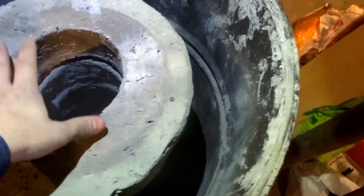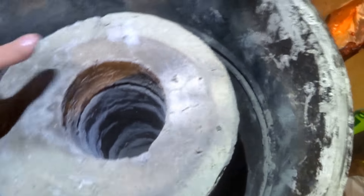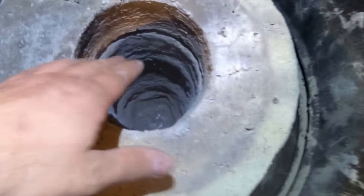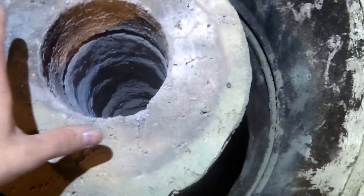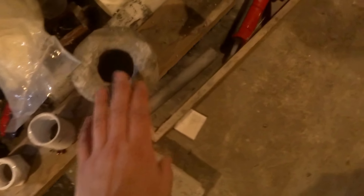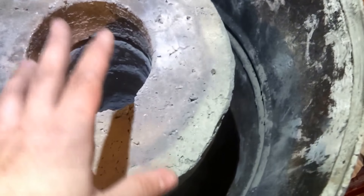I've decided to add one of my heat risers that I made last year, trimmed around the outside so that it matched up with this 15-gallon barrel. I lined up the holes and I'm planning on coating this whole thing with my refractory lining cement, like I did with the crucible sitting over here. I'll be coating this heat riser, cleaning off the magnesium silicate all the way down, and coating the outside wall of the heat riser as well.